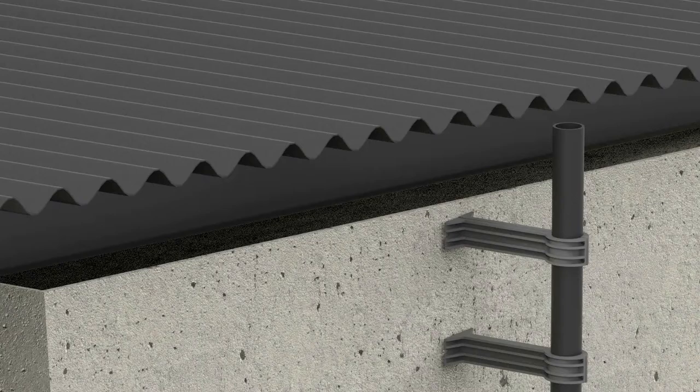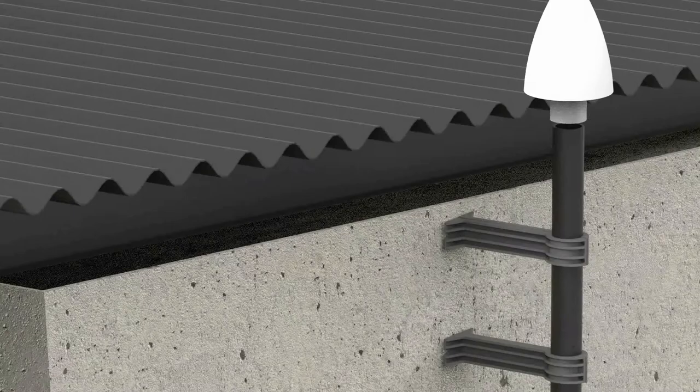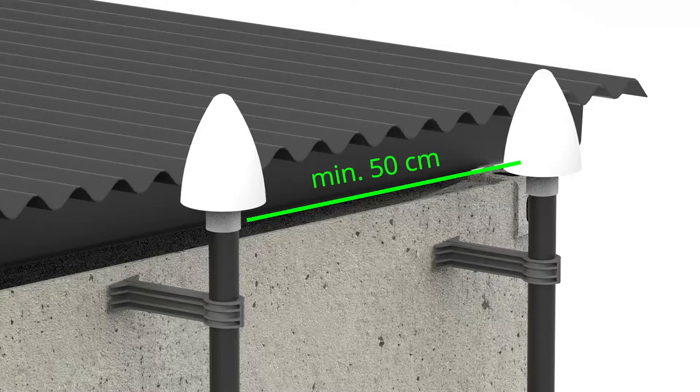This done, you can now pull the coax cable end with the male end type through the retaining tube and connect it to the antenna. Also make sure that the antenna is mounted at a distance of a minimum 50 cm from other antennas. Connect the other end of the coax cable to your time server.